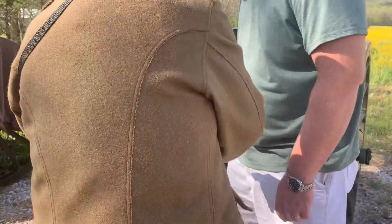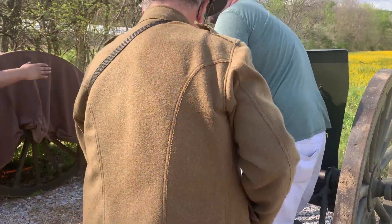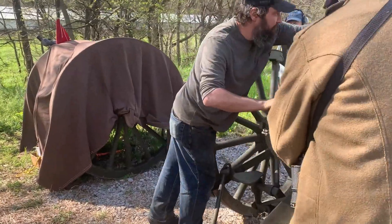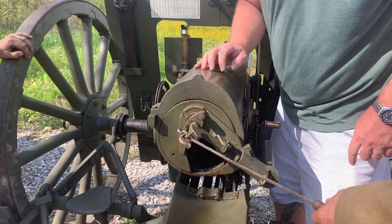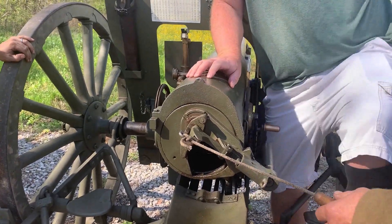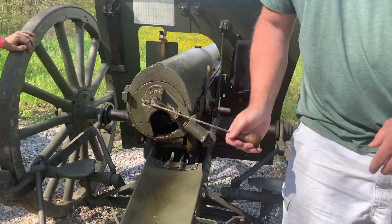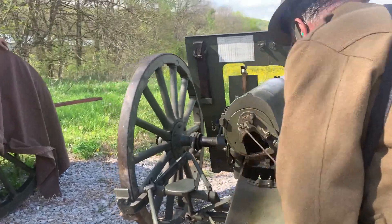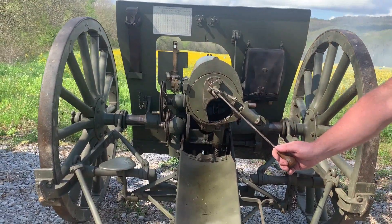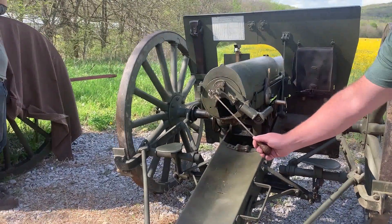You're probably straddling it — it's more simple. Put your right leg over there. The barrel is going to go back toward you — that's the barrel recoil, but the carriage won't move. You can stand back here. It's dug in good. Pull it in a straight line, because if you don't pull a straight line it'll lift and partially open the breech block, which would be bad — it would just stop the gun, it wouldn't fire.